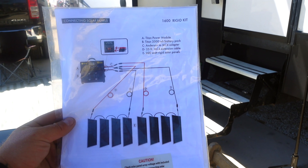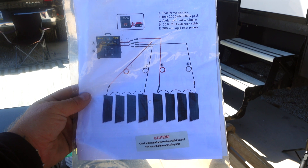Here is our diagram showing how we need to run our cables. We're on the final steps of finishing the electric for our solar generator. I've got the wires completely run through the wall. I'm getting ready to cut out a small section at the bottom base of our floor and baseboard to run the wires down out the bottom of the RV and to the generator bay. My only concern is that the floor is much thicker and more dense than it was to go through the wall and up through the roof.